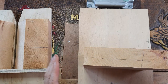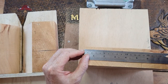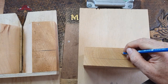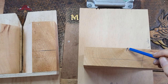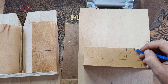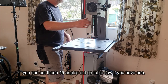The first thing to do is cut a 45-degree angle through there. I take it to the middle, so that's about 10 inches about there. You want it kind of even on each side, and the 45 will go there. So I've got this table and we're going to move the table to a 45 degree. Always take the arm up when you do that so nothing gets hit.